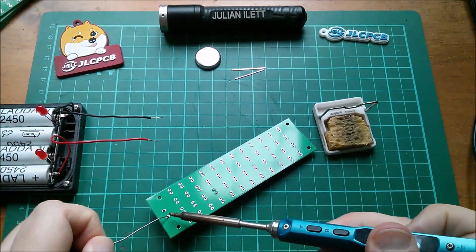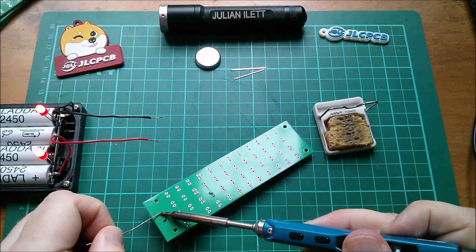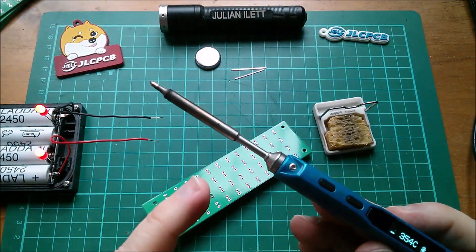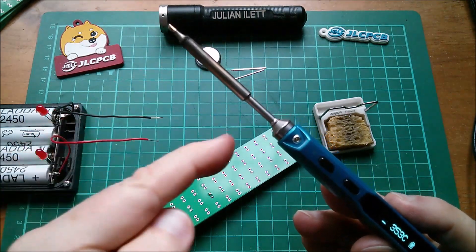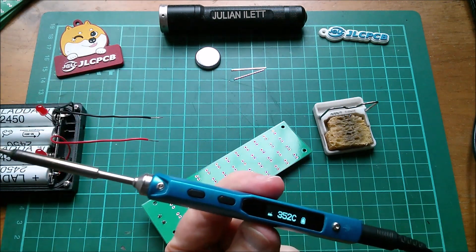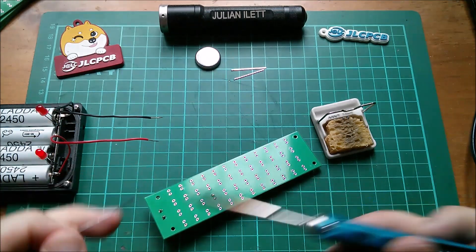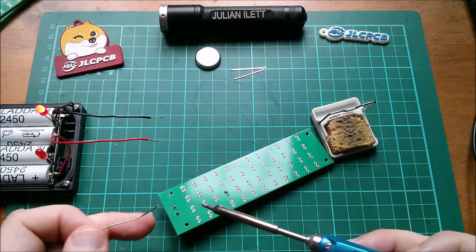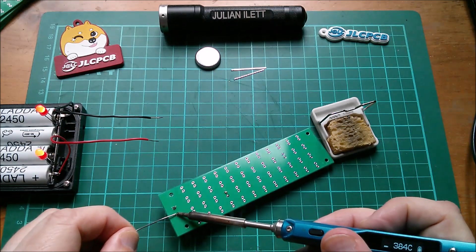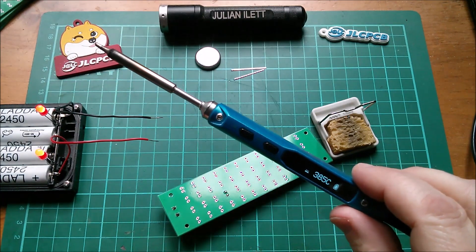Let's solder the connector in. It's slightly more problematic — I think I'm going to raise the temperature because it seems to be struggling a little with cooling down quickly. If I raise the temperature of the thermal mass, I'll have a little bit more energy at the tip — thermal energy. When that gets sucked out by the board, the board's going to get that much warmer. I'll go over these again at this higher temperature. Yes, I think that's probably better at 385 degrees.